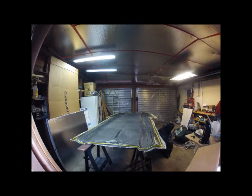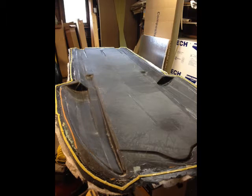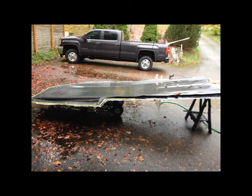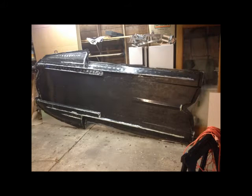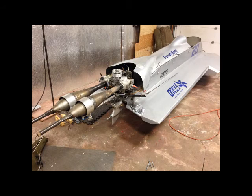Sweeping up some of the dried resin. Here's a shot of it with all the stuff removed. Next we got it out of the mold, which was pretty tough — took a few hours, a lot of wedges, a lot of time. There's a picture of the part out of the mold. You can see there are a lot of sharp edges — it's a pretty complex part but it came out pretty well. This is a picture of the original boat — an all-wood boat I used as my plug to make the mold. It weighed about 200 pounds, and this new boat should weigh about 100 to 110 pounds. That's the motor and basically the whole boat. Thanks for watching.